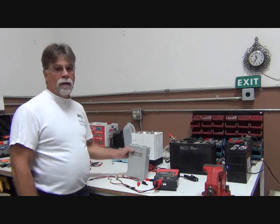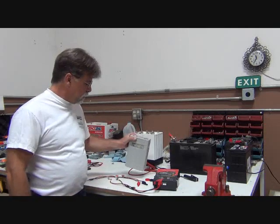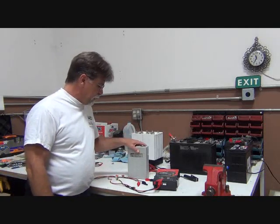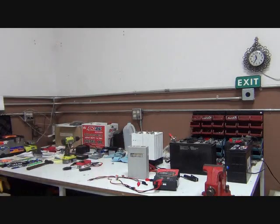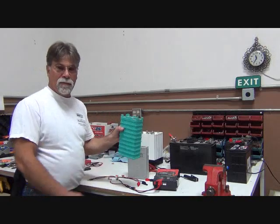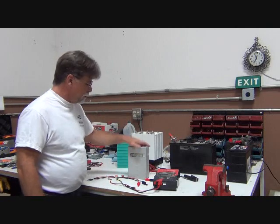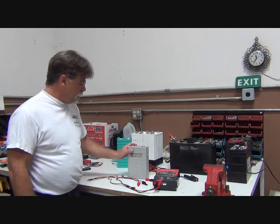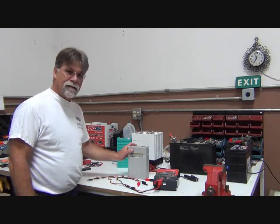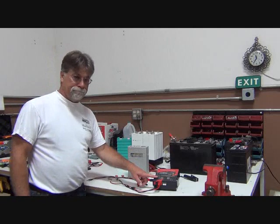And that is, you want to be able to take your lithium cell, this is a Calb CA series 100 amp hour cell, but doesn't really matter. Here's a high power 100 amp hour cell. We have the GBS 100 amp hour cell. So, bottom line is we want to bottom balance these cells for our electric vehicle conversion. That's the objective. And we want to do it using the Cellpro PowerLab.